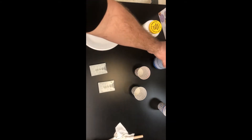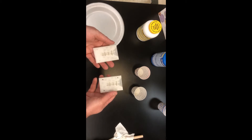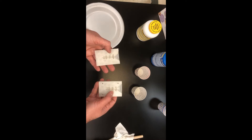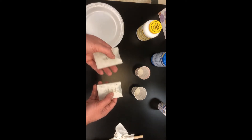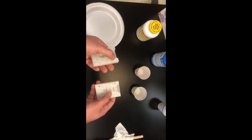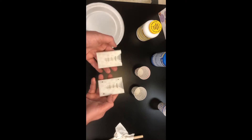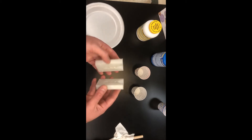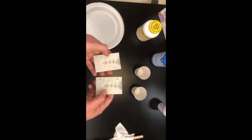You can see in the molds that I designed here, I have one half of the chest piece removed from each of the mold pieces, and on each piece I have mating parts — pegs on this side that line up with holes on this side. It's really important that when you design a two-piece mold like this, you design it in such a way that the two halves are going to be perfectly aligned.